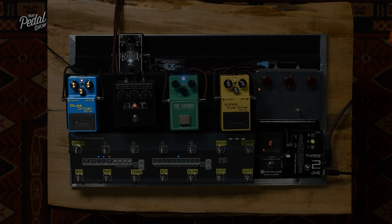Just hear me out on this. I wonder if I was hearing ugliness in some of the harmonics. I felt like I was hearing more ugliness in the harmonics out of the guitar. Could you try giving me full-on silicon diode clipping and then change it to one or the other? Matched, okay, mixed. Here we go. That MOSFET must have a higher forward voltage there because that gain is... It's just because it's so much louder. I can hear so much more, is all that's happening.